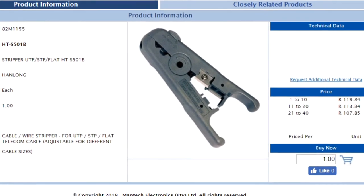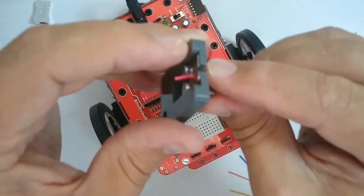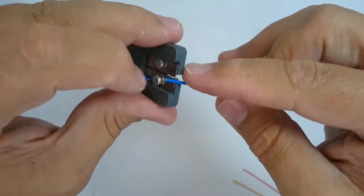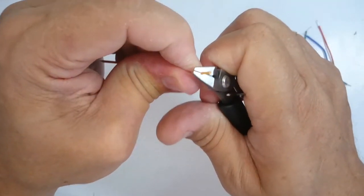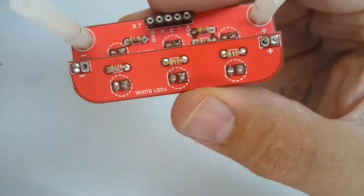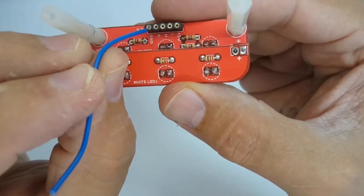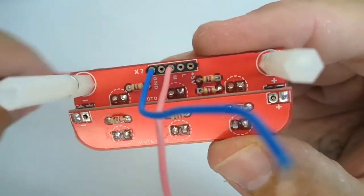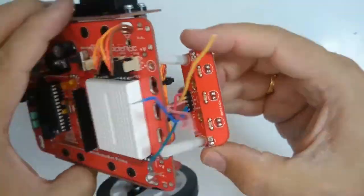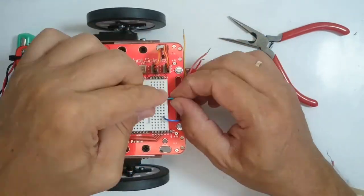The wire stripping tool made from pencil sharpener blades spaced slightly wider than the wire cuts through only the covering insulation when you insert the wire and spin the device. Then when you pull on the wire, the insulation comes off without hurting the wire inside. By comparison, side cutters require much more skill for a similar result. To make it easier to film, the line following module has been removed from the robot. Insert a blue wire into the ground socket, a red wire into the socket marked 5V, and green, pink and yellow wires into the left, middle and right hand sensor signal connector sockets. Then screw the module back onto the robot chassis, bend the wires and feed them through the holes into the breadboard.